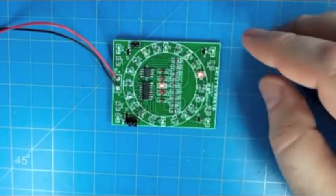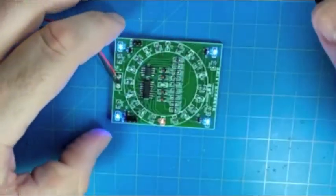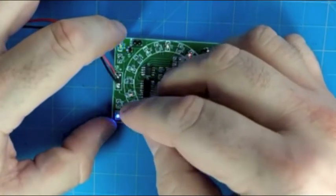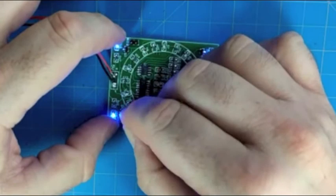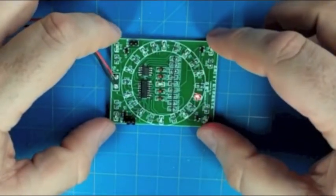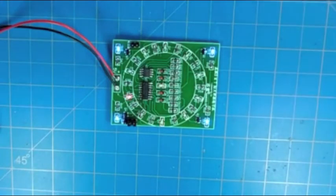And then every time you trigger the carry, we'll see how that happens. When we trigger the carry, which happens when the rotating LED effect is at either of the side positions, that toggles the state of the 4 blue LEDs because they're connected to the carry output. So, all right, well that's it.